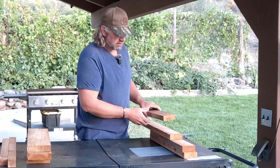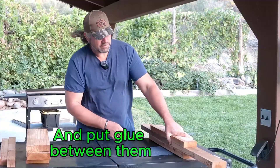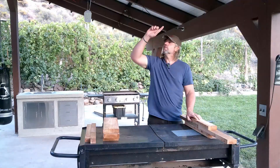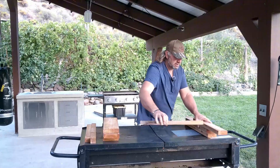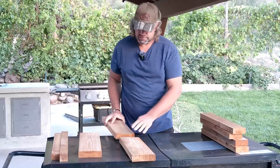You take your two-by-fours, spread them so you're offsetting your joints, put glue between them, and then I put these on the I-beam and clamped them down — that's how I made the rafters. For the posts and the beams, I used two-by-sixes, same thing, offset them.